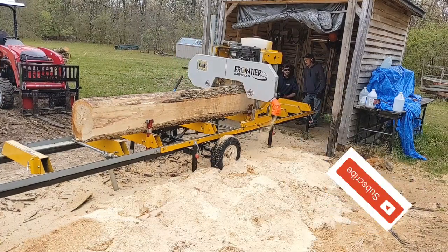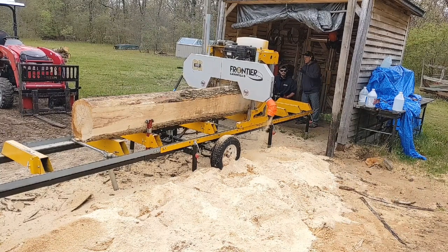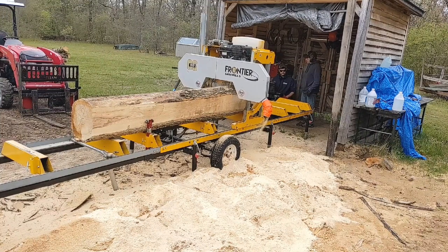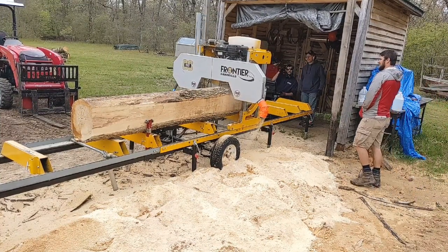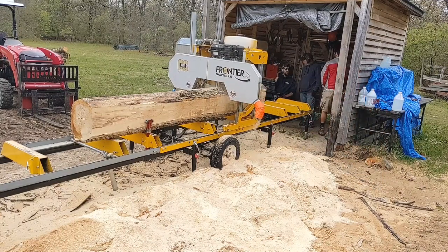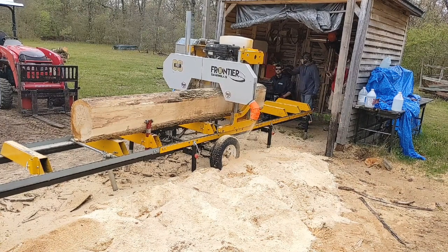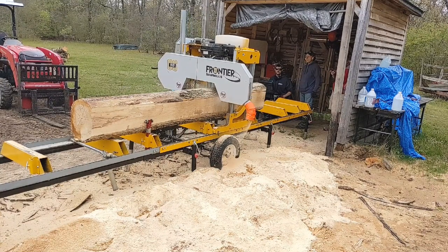So cutting the half inch board will be a little different, because we don't have soffit, so you'll have to go down 5/8 every time, because the blade takes an eighth inch out. And first running into it, what are the signs that it's not good? You just don't want to slam into it. That's why I work into it slow. Once I'm into it, then I speed her up.